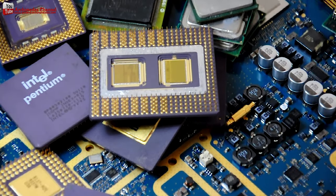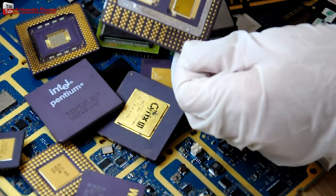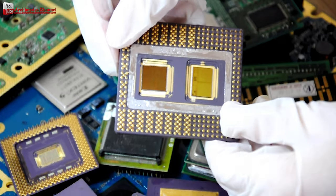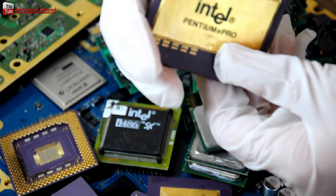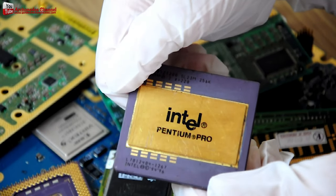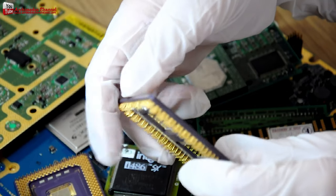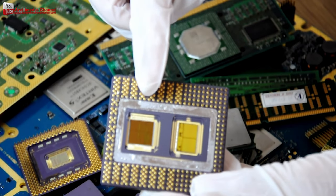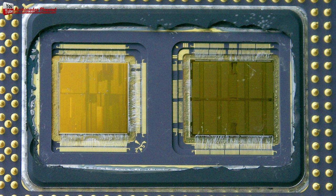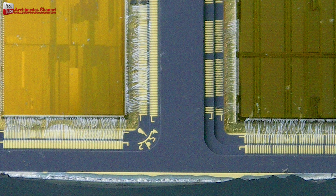The CPU is the focus of gold recovery, but don't believe the gold yield figures from material vendors. From my work, the Intel Pentium Pro CPU doesn't have a lot of gold in comparison to its weight — I get no more than three grams of gold per one kilogram of Intel Pentium Pro CPUs. Observing the inside of the CPU, it does not use gold wire to connect, and the size is big and heavy, though gold may be hidden in the ceramic.